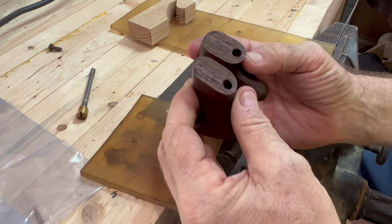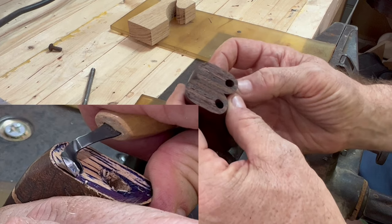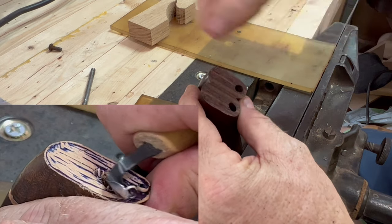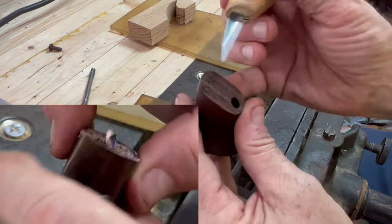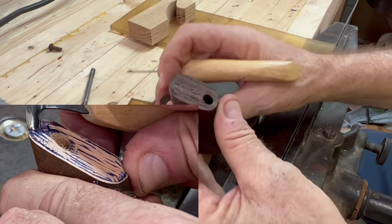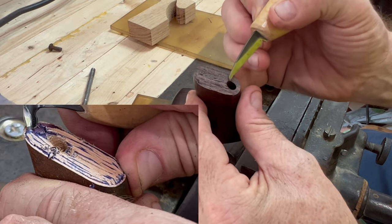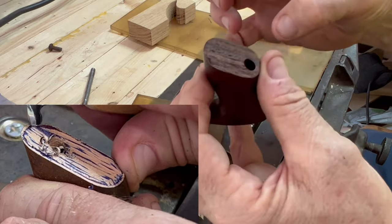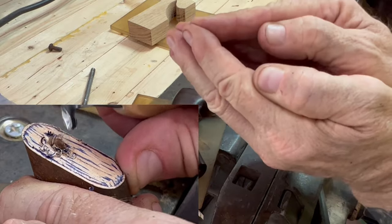What I have learned is that because we're using epoxy, we don't necessarily need clamp pressure like you do with PVAs or other types of glues. But I'm going to go ahead and use a little scorp tool, and I'm going to basically peel away any oxidation or any surface that was here. I call it my avocado technique. What I want to do is leave this margin. Don't come anywhere near this outside perimeter where my two edges join, right? We're going to kind of hollow the two surfaces just a little bit to create what might be like a clam shell. If you think about how a clam closes, the clam is inside, but the outside perimeter, I know, gross, right, is where all the pressure is. That's what I'm trying to create.